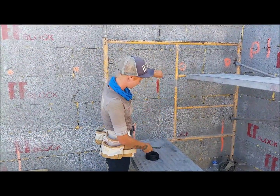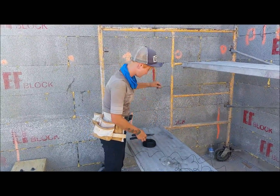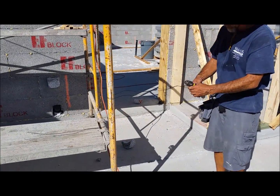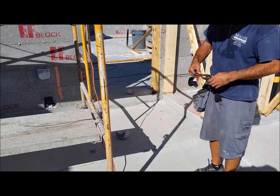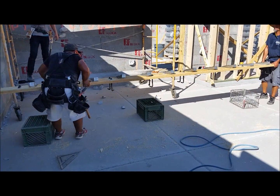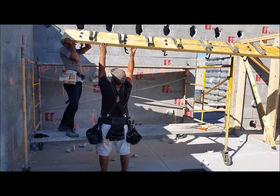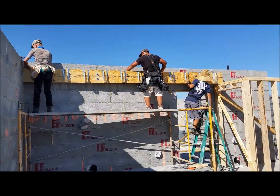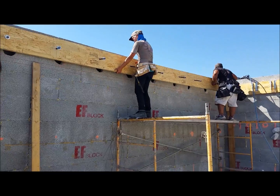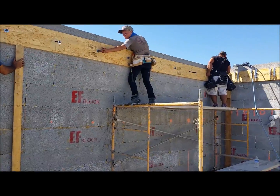Pull the wire up about two feet, cut it, then straighten that wire out, tie the bolt, and pull that ledger board tight. Wrap it around something like the scaffolding here and pull it tight, make a loop out of it. Get everything on the ledger, then just lift it up and put it in place. We did everything down there on the milk cartons — it's a lot easier than doing it up in the air. Push it up in there where you want it.